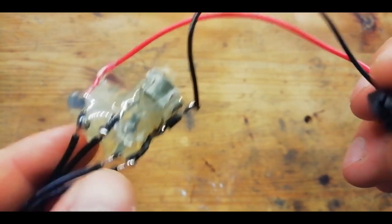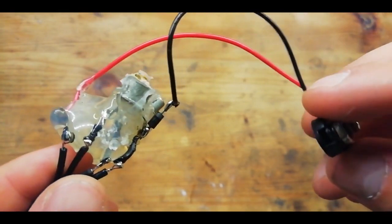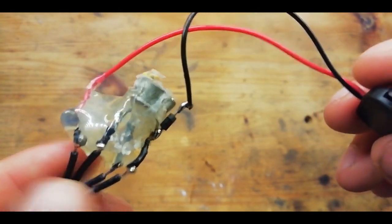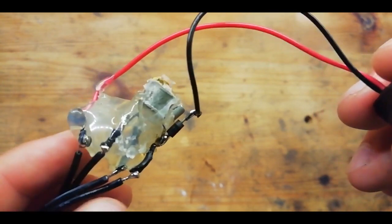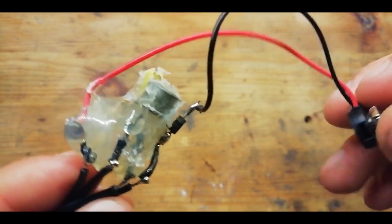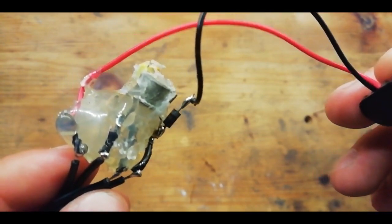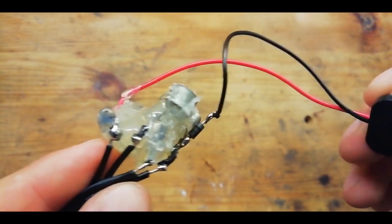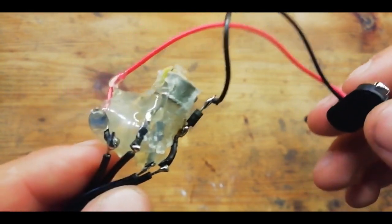The LED tape has a maximum voltage of 12 volts, so there's nothing stopping you running it up even further, and the 11.1 would probably be really bright. However, the main issue I found is you cannot run this off of the gun battery if you've got an AEG, because the current draw from the AEG firing, especially in full auto, can cause this to cut out completely. So you want to stay with a separate battery for an AEG.